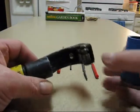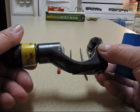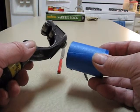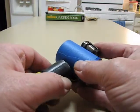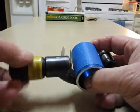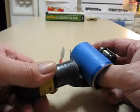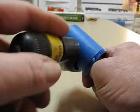The way I start is with a tubing cutter. I'm going to mark a ring on the light with a tubing cutter, and I've put masking tape over top of the metal so that the tubing cutter is only going to leave just the mark that I want and not put any gouges or any other marks on it. Then I'm just going to take the tubing cutter, put it in there, tighten it down, and run the tubing cutter around the pipe — seeing as how I'm using a real small piece of pipe.